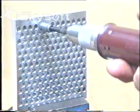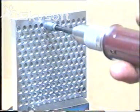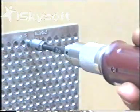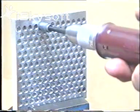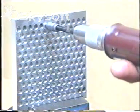The clutch should be set so that the insert will fully install. It has to be done by trial and error. Don't set the torque too high or you may wipe off the tang during installation. With practice this tool can be very, very quick. But beware, it should not be used with screw lock inserts, and it's not available in smaller diameters.